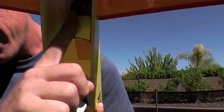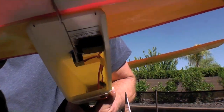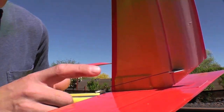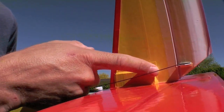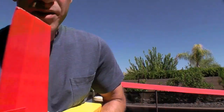for landing. This servo you see is mounted to a plastic gift card that has been bent into an L like this and placed up through the fuselage, through the horizontal stabilizer, and adjacent to the vertical stabilizer, which you can see here under a piece of tape. This provides a nice stable point of attachment for the vertical stabilizer with some two-sided foam tape between the stabilizer and the card itself and a little duct tape over it just to smooth it up. And that is supplemented with a fillet of hot glue right here.